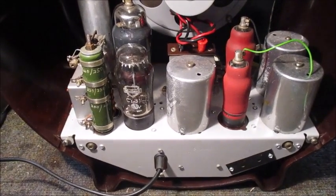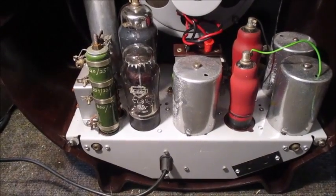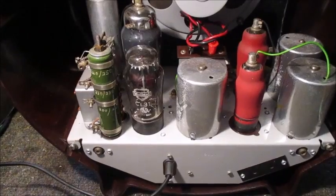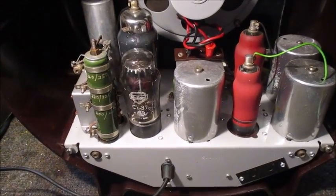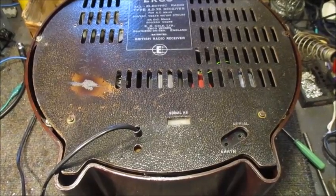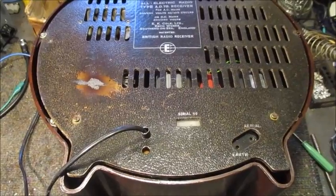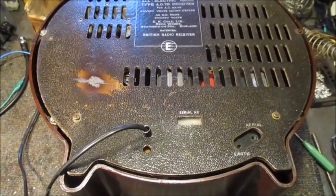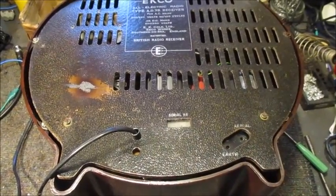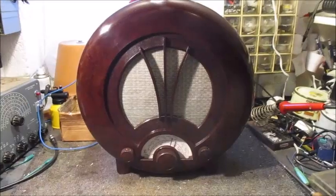Okay, I'll screw its back cover into place and we'll turn it around and see how close BBC Radio 4 is to 1500 on the dial. As you can see, making up a new board where its mains lead boot has been moved up 6 millimetres has enabled me to avoid making an unsightly hole between the two existing holes. Using the top hole has made for a neater job.